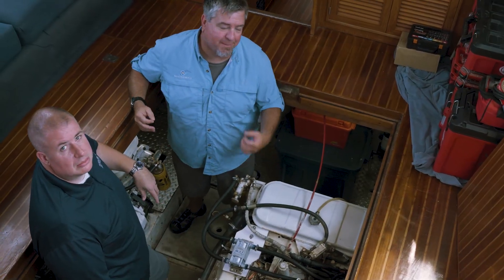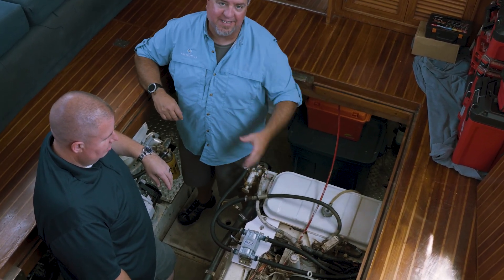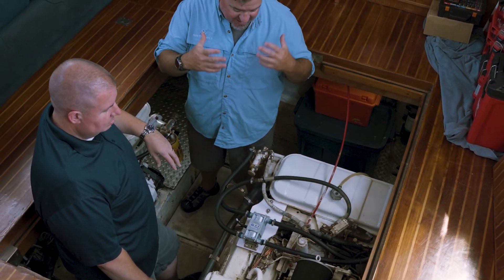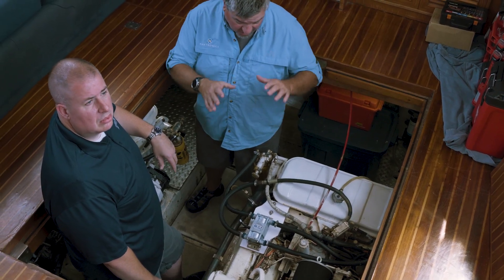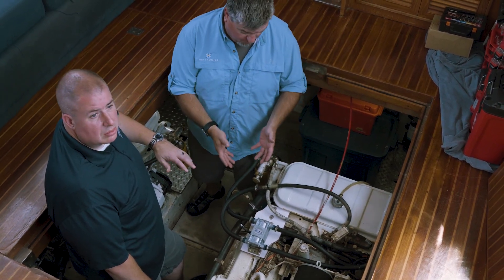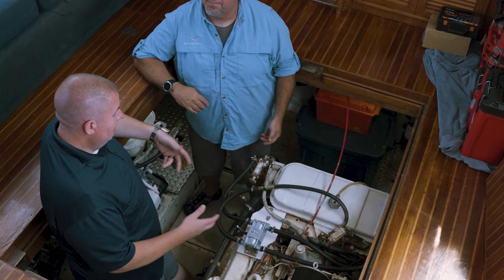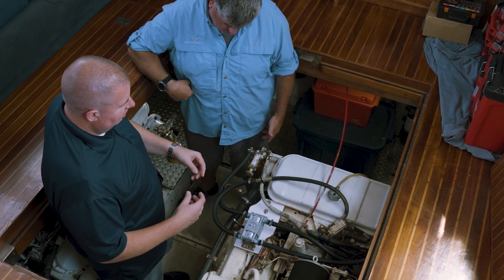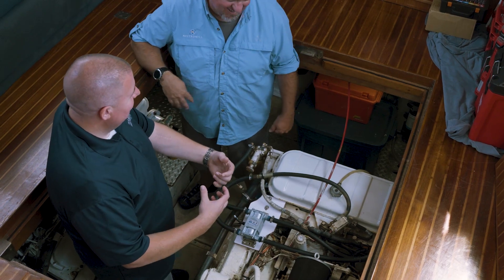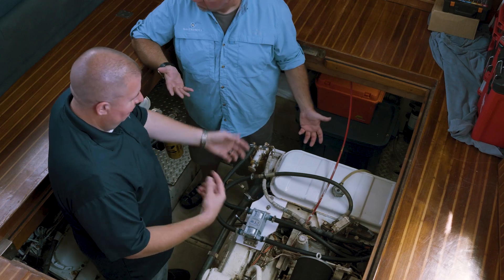One of the great features here is this Smart Flex fuel sensor for diesel engines. With a diesel engine we have a feed and a return line, which creates a much bigger footprint. But with this Airmar Smart Flex sensor, Chris can tell us more — this is a really small footprint for the install. Exactly — the whole idea behind the design was to have an all-in-one unit with a small footprint, no need for extra fuel sensors for the diesel or extra cabling. We now have it all in one package with the feed and return differential.